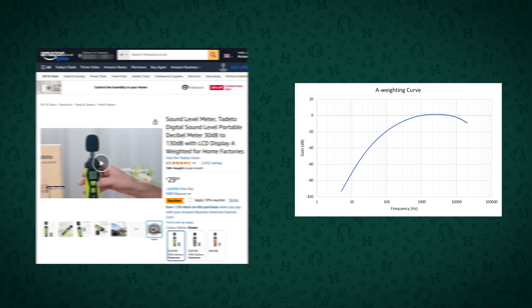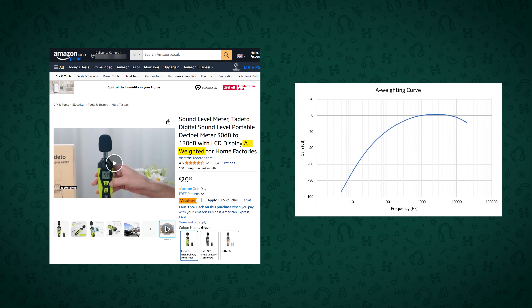The volume that you are perceiving — and what's measured with most SPL meters — is not flat against all frequencies. If you play a 3 kHz tone and a 100 Hz tone at the same level, that 3 kHz tone will not only sound louder to you, but the SPL meter will probably tell you it's louder as well. The A-weighting scale, which is what most SPL meters use, was introduced to accommodate the fact that we don't hear everything at all frequencies with equal loudness. On top of that, whilst the sensitivity specification for most headphones is given at or around 1 kHz, the bass content in music can be drastically higher in level than everything at higher frequencies. So the actual amount of power, current and voltage you need can be a little more complicated than what it might seem based on an SPL measurement or what you put into a calculator.